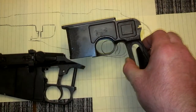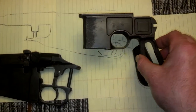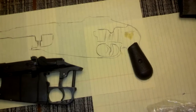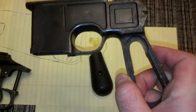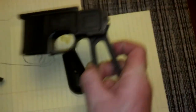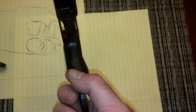So it should be perfect, or at least close enough to the actual bore axis that it'll recoil similarly, if significantly more so. We'll probably also be doing it thicker. The C96 used a very thin frame in the grip area — the 30 Mauser cartridge on a big gun doesn't really put all that much stress on the metal, but this one might. So we'll probably wind up leaving it solid in between and maybe doubling the thickness of the center section between the grips.